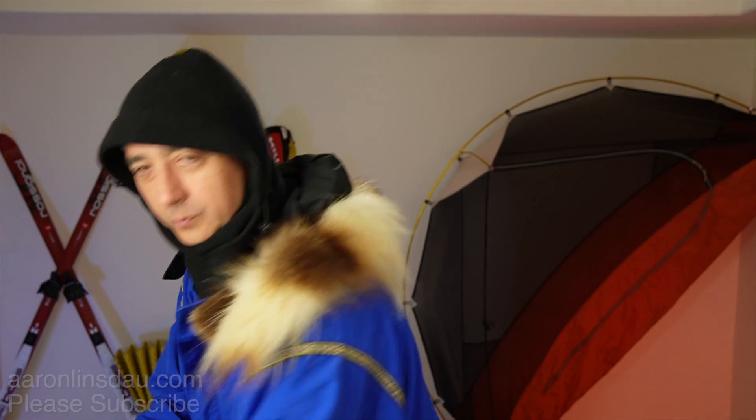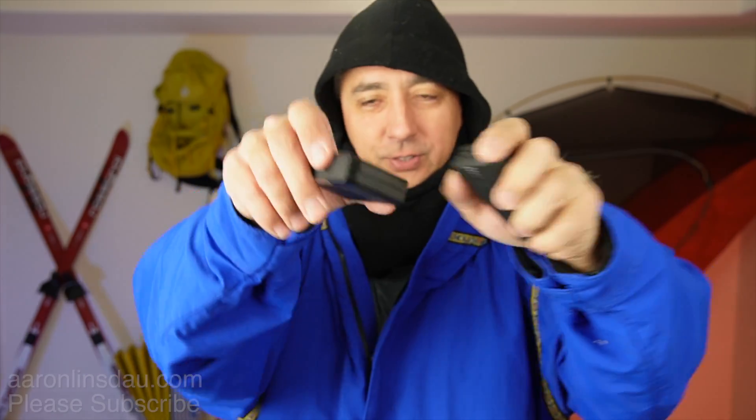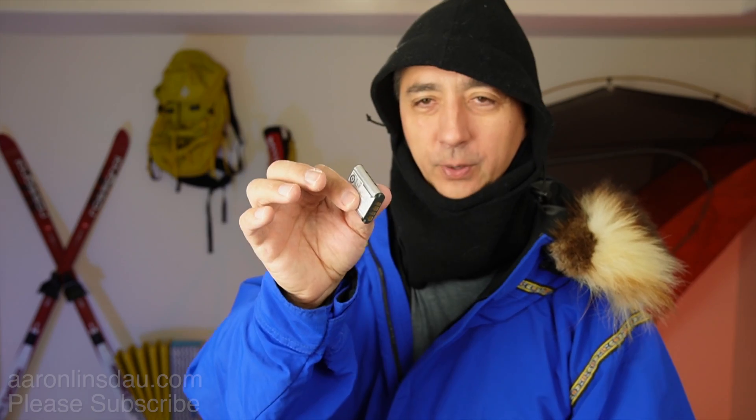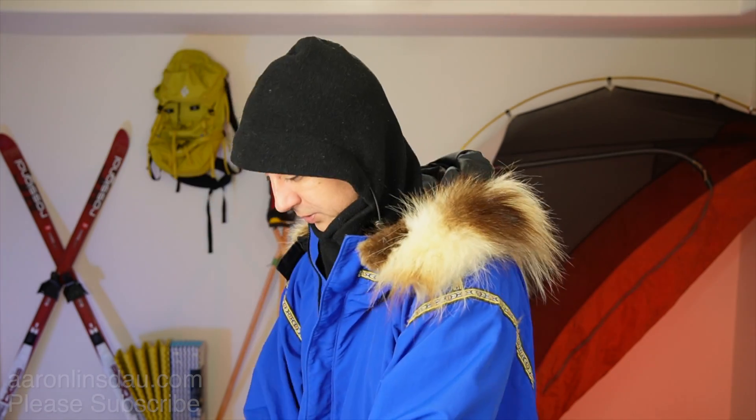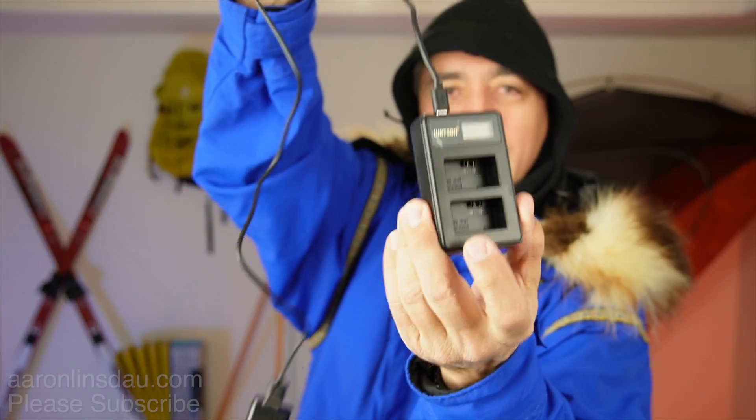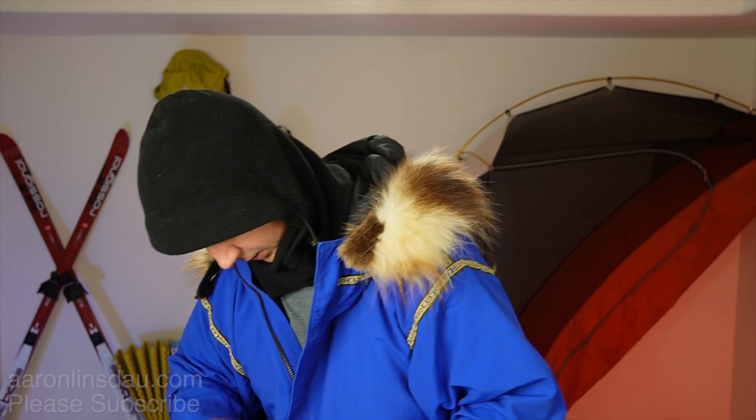Instead of just setting your battery out with your charger in your tent sitting there totally freezing — don't do that. Because the battery will say it's totally charged, but it is not charged. These little chargers lie to you. They think the battery is charged and it's not, because when the battery is super cold, the temperature isn't high enough for the battery chemistry to work for the charging voltage to detect correctly. It thinks it's charged up, but as soon as the battery warms up, it dies. That's a big problem. So you need to make sure your batteries are warm.